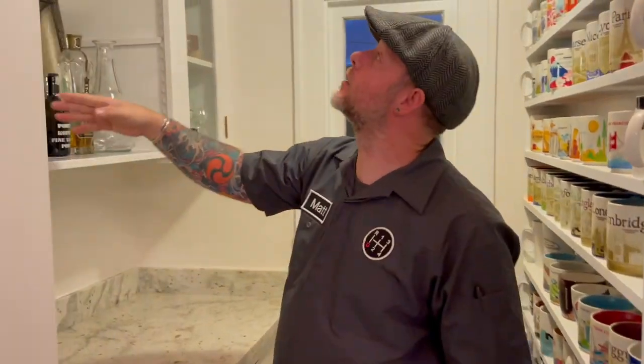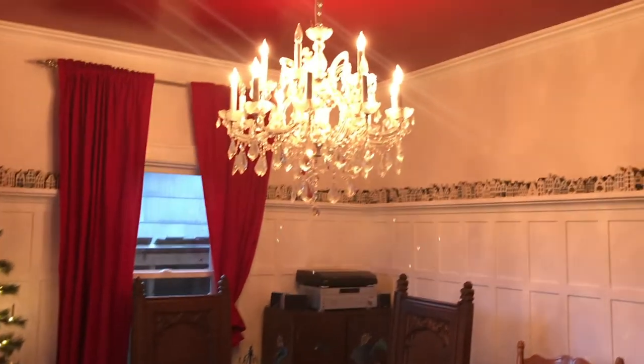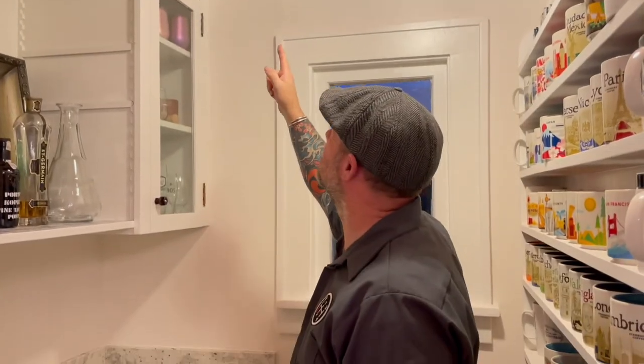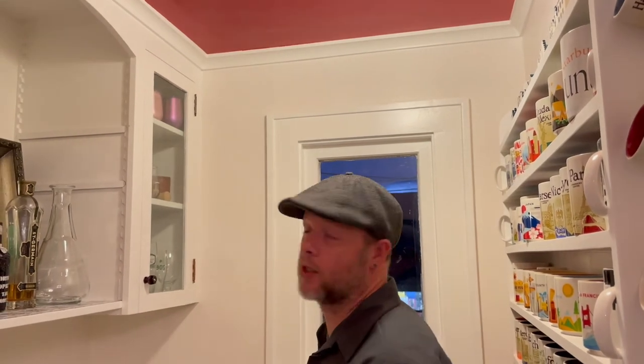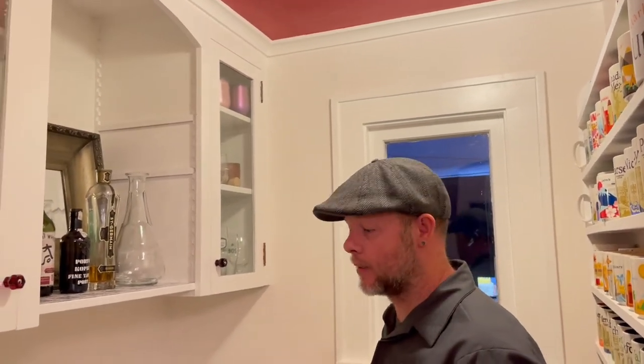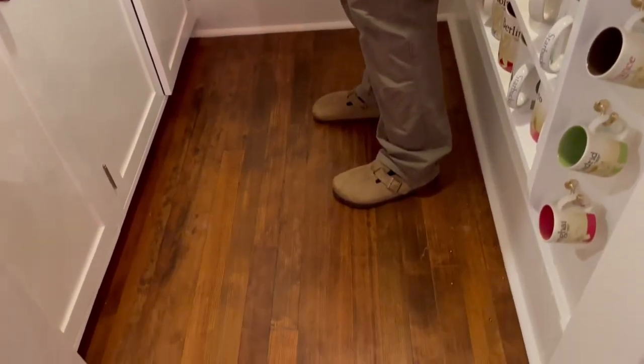This pantry has worked out really well — it turned out even better than I dreamed and more usable. The little details matter: matching the rest of the cabinets, making the cove molding match the house — not MDF home depot cove mold, but two-and-a-quarter cove crown made on my table saw to match what was originally here. The walls are painted, the floor is beautiful, and I'm going to put a mat down to protect against spills.